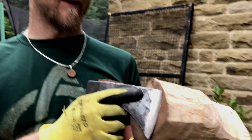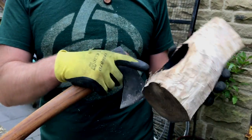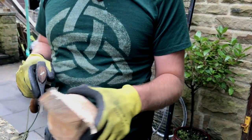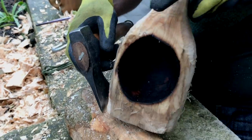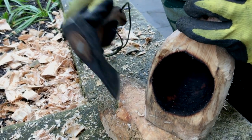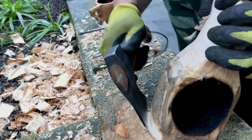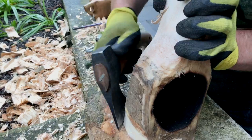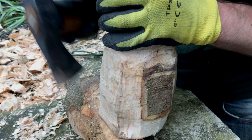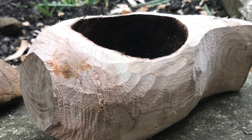Now I've more or less shaped the back end of the cup. Notice I'm leaving that bit flat — that's just to make it easier to work with, and also if you chop the bit that's near the hole too soon it will crack as it dries out. When that's done I'll start doing this other edge, and the way to get it round is just literally chop up against the wood and then turn it as you go in so that it keeps going round, keeping it even all the way around to make the whole thing more cup shaped.